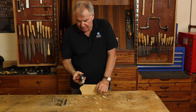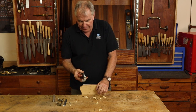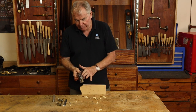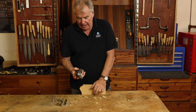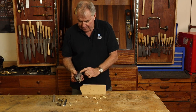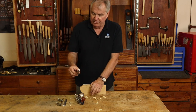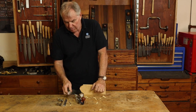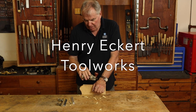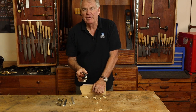So it's quite a versatile tool. It's a block plane, it does tenon cheeks, it makes accurate rebates whether small or the full width of the plane body. It's got the extra 45-degree fence for accurate chamfers — you don't need a separate chamfer plane. And you can add different fences to the primary fence to cock the plane at different angles, for example for raising panels. That's our little rebate block plane. I hope you get a chance to use it or see it one day. Thanks for coming by.